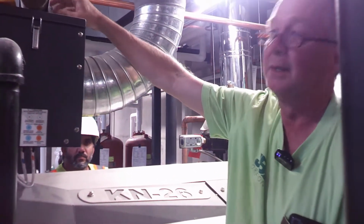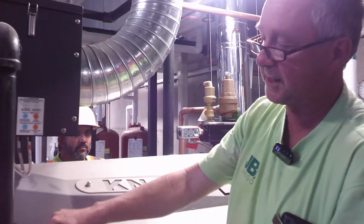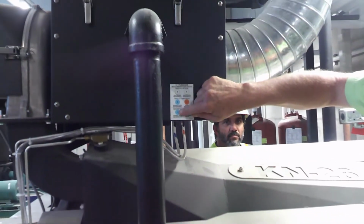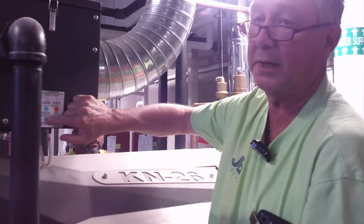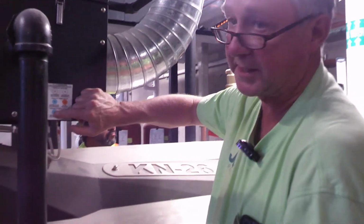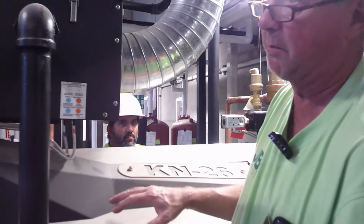The burner, nothing. Filters only filter so much. Those particles pass through. The slits on these burners are about the size of that number 1. There's thousands of them. So if you get a bunch of dust or mosquitoes, yes, mosquitoes. I had an air filter that was almost fully plugged with mosquitoes one time. So if those little slits get a patch like this, it can create a hot spot and take out your burner.